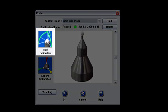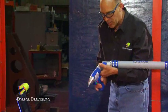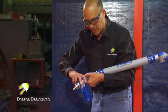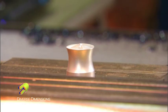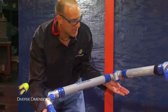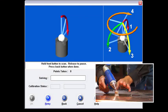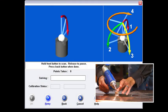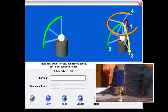Now I'm going to jump into this single point calibration, so I'll click on that. Now I've got this screen right here, which is a great illustration showing how I'm going to go through this calibration. I've got a seventh axis on my arm — this trigger or pistol grip. If you've got a six axis arm, you'd be grabbing right around here. I like to have the calibration cone a healthy distance away from the arm base, and then I let the arm rest since it's counterbalanced. I put the probe inside the cone and start with my finger lightly touching the probe so I know it won't come out. Then I'll push the green button and swipe up, swiping a little more than a 90 degree path.